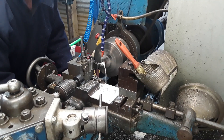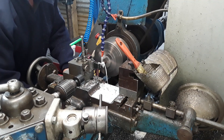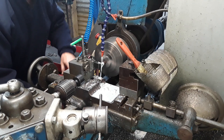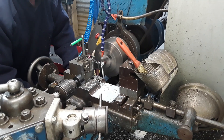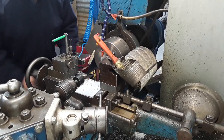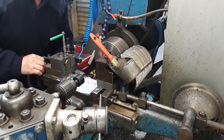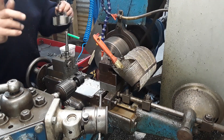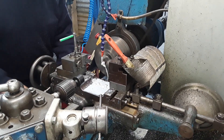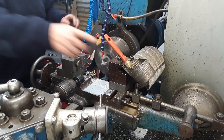Second cut now — this is down to the final diameter required to cut the quarter inch BSW thread on it. I'm actually feeding this by hand; this lathe does not have power feed, it's that old. And that's our shoulder length. This tool over here is a chamfering tool which will give us a chamfer for the lead-in for our thread. Before that tool goes back in, I change it out — this goes over into a parked position, ready to chamfer and ready to part it off.